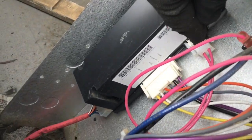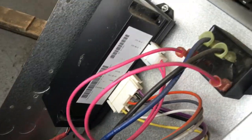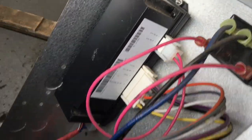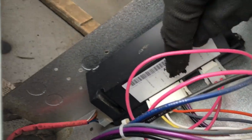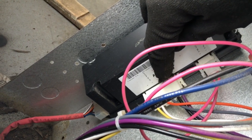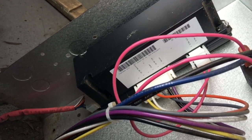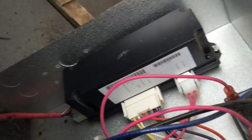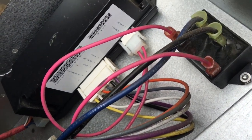Signal going out to your compressor coil right here, 12 volts DC relay. That's your compressor relay right there. You got your defrost, your 120, your evaporator fans, your 120 neutral, and your defrost heater circuit. That's your relay pack. Compressor. These will stick a bunch. I've seen these things stick.